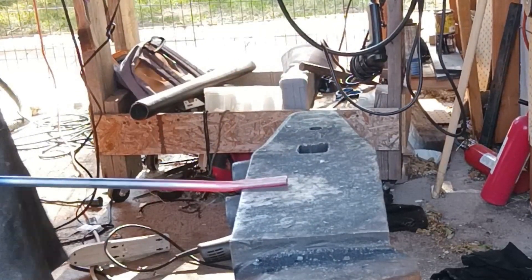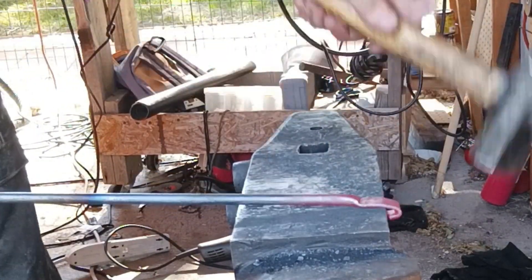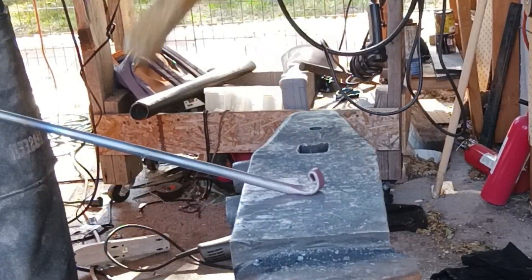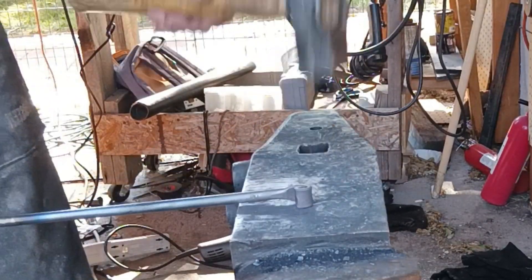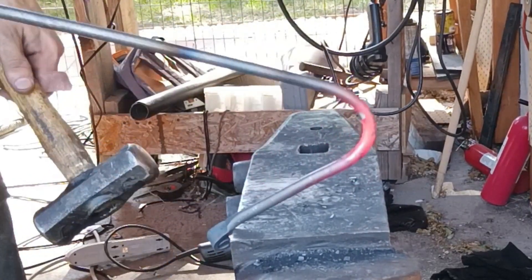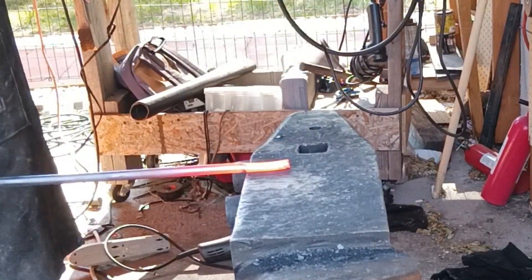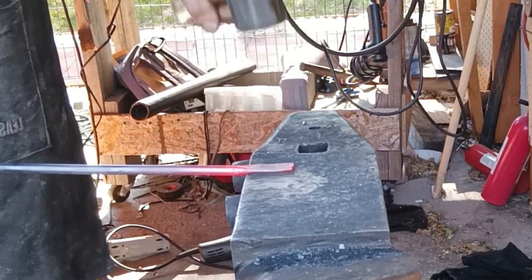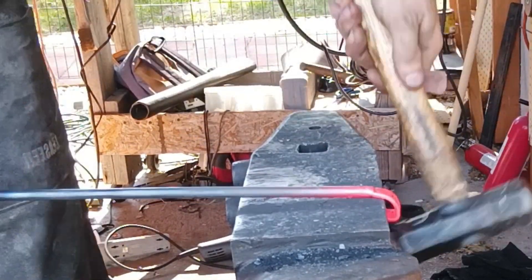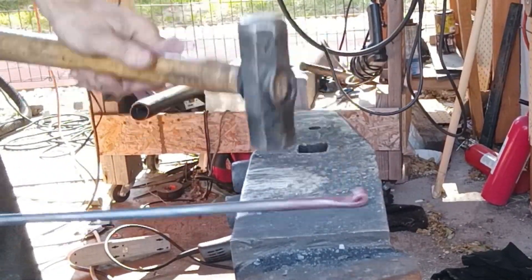This applies to each and every one of them. We're not trying to be exactly precise — I do want each one of these handles to be slightly different in size and each one of the scrolls slightly different in size, so that way each one has kind of its own personality. One important thing to note when doing scrolls: if you want them facing the right direction, always roll the opposite direction that you're going to bend the loop of the handle, so that the scroll ends up rolled up in the front of the handle rather than being rolled up against the handle.